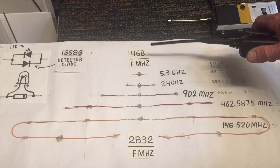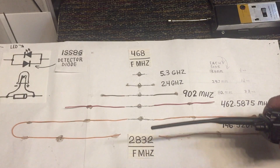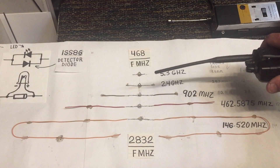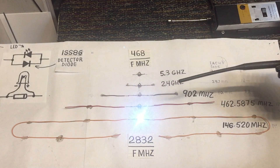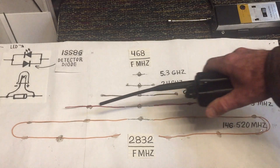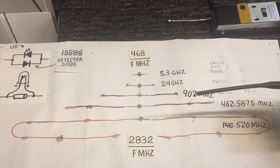What I put together here is a little series of antennas that have an LED in the middle, capable of lighting up when I transmit. When I transmit with my little walkie-talkie here, you'll notice that only the light comes on on the bottom — because that antenna on the bottom is designed for this particular frequency, which happens to be 146.520 megahertz.